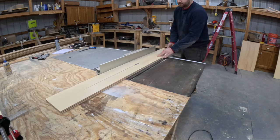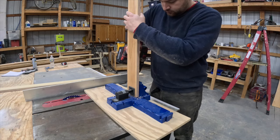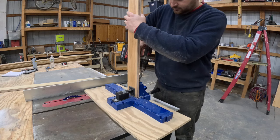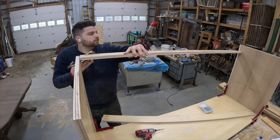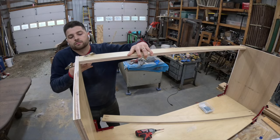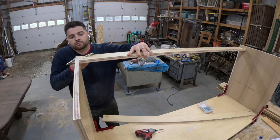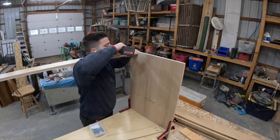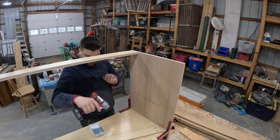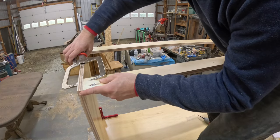While we wait for that glue to dry, I cut some support pieces out of the remainder of the plywood and drilled pocket holes on each end that we will use to attach to the top of our cabinet and lock everything together. If you're going to be building more than one or two cabinets, I highly suggest you pick up these pocket hole clamps — they fit right into the pocket hole that you drilled and act as a second set of hands while you get everything screwed together.